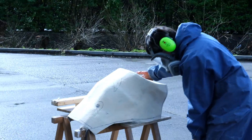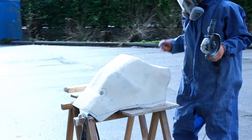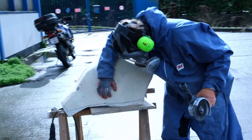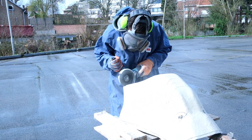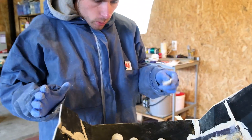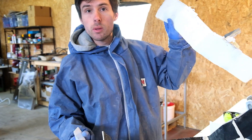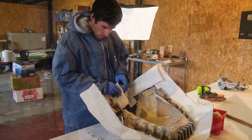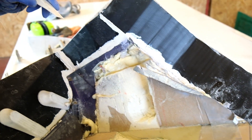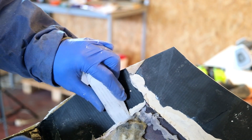We rough cut the mold, and now we will finish the mold by giving it a smooth edge so the vacuum bag will be easier to apply. We're using flanges to remove the piece — the entire flange we had is removed, which is a good sign. It was easy to remove — just hot glue and then pull it off. Now we're trying with wedges to go under it and we'll see how the finish looks on the mold.